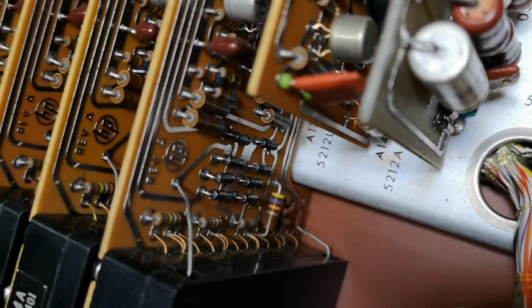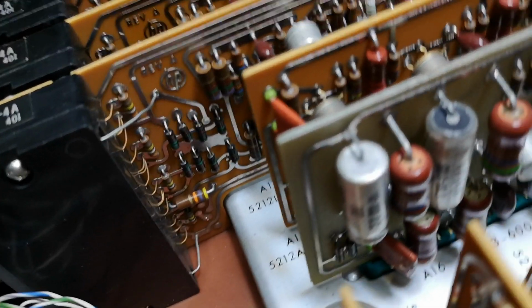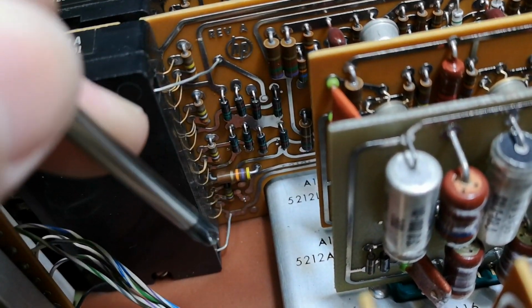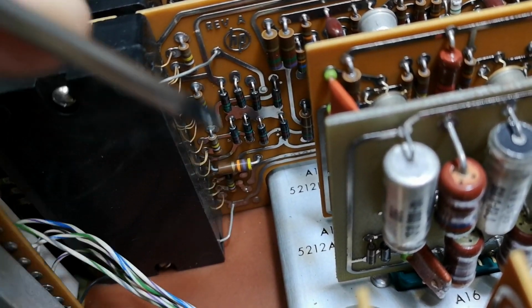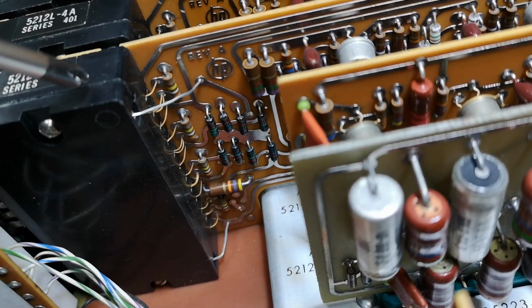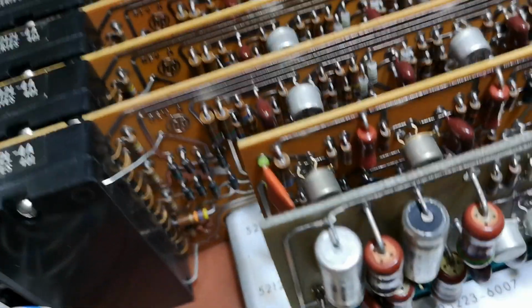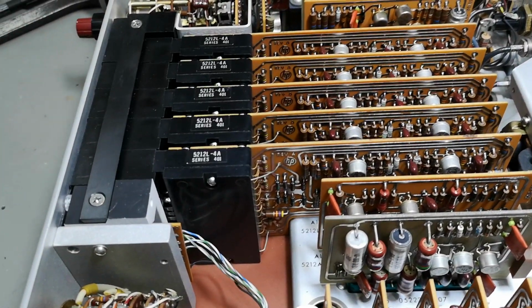Oh yes it is. That is exactly what it is. Yes, they are doing that. Exactly the same thing. And you know what that is? So that is the sort of Charlieplexing neon bulbs, and the neon bulbs drive LDRs, and the LDRs drive the Nixies. Yeah, that's how it is, right? This is exactly how it is. We gotta go in here.